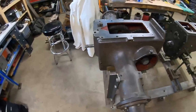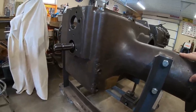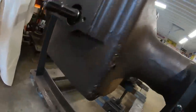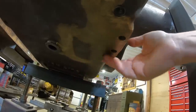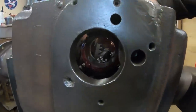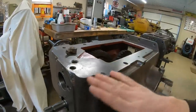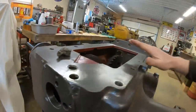In 2007, we took this casting down to Midwest Cylinderhead in Nevada, Iowa, because it was a one-off — if they couldn't fix this back end, the tractor was essentially dead. They literally worked magic on it. They did a thorough preheat to the whole thing in an oven, then did a comprehensive braze repair, put all the pieces back, veed it all out, added material where the drawbar bracket had broken out. They also did live power shaft bearing bore repair that we then had to build custom boring bars for to return everything back to true and in-line.